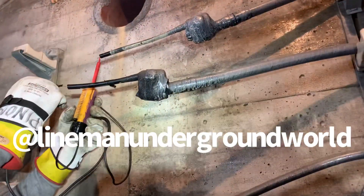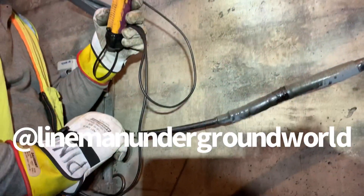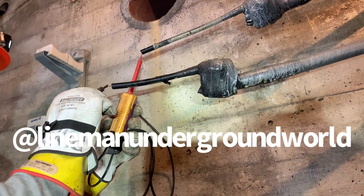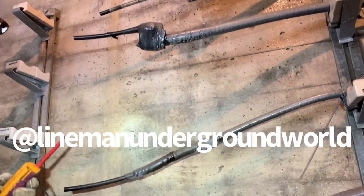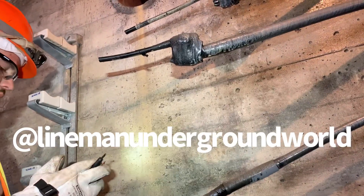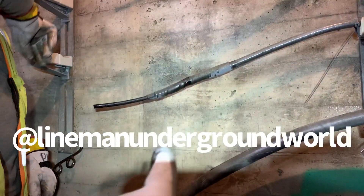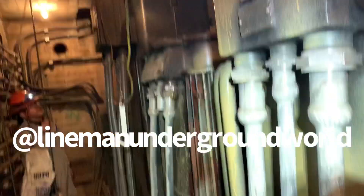Now that we've pulled in our cable, we're gonna tap into our leads here. We need to find out for sure if it's 120/240 or three-phase. What do you got? — 240. We got 120, 120, 120. Never assume the middle one is always the neutral — we've actually got three phases here. Mark it with white tape.